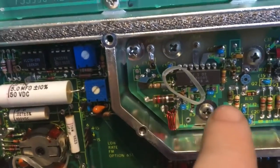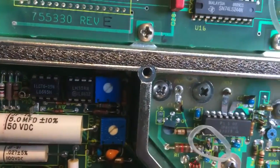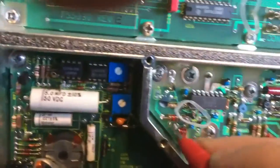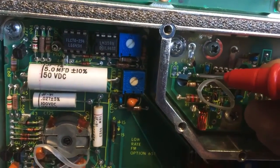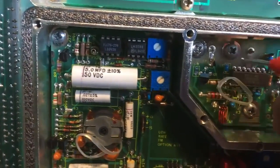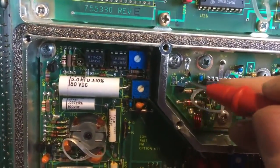I've got the VCO hooked up — that's the VCO right there and that's the IC it's running. So there's the output resistor. You've got 15 volts coming in on this side — 15 volts. On this side I'm getting 6.6, which is a bit low because the dropout voltage of the regulator is probably about 1.8 volts. Measuring on the output of the regulator I'm getting 4.8, which is a little concerning. On the output of that other resistor, still 4.8 — so there's a drop in here.